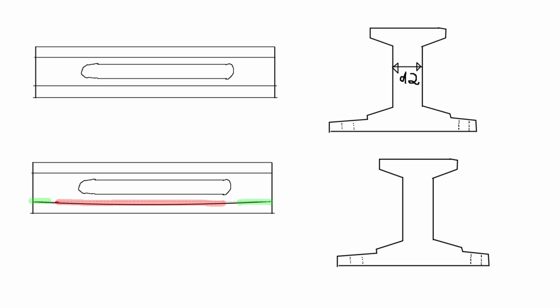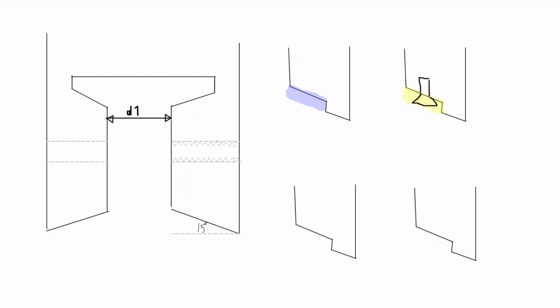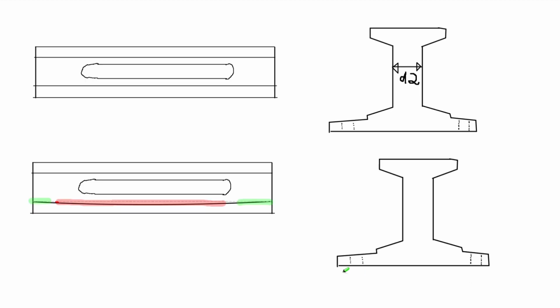And with a mill, if you look, we have the feet here. We have feet here and there, and these are machined. So these are our references. You just clamp this to the table and then you can machine away good metal. Unfortunately, we need to remove good metal and get it down to this level here. So we remove the good green metal here and make it all as bad as the middle is.